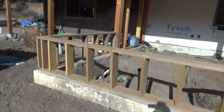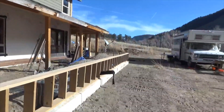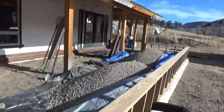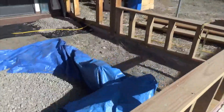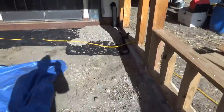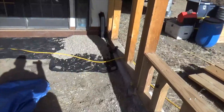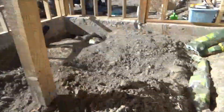It's Monday morning and we got the entire cheek wall up. We're going to finish the plumbing inside today so we can level it all out. Half is already leveled and we've brought in most of the crushed stone. You can see here we've set this up — two layers of fabric cloth and about four inches total of crushed stone — that's our plan.